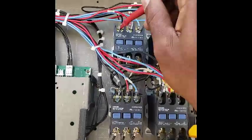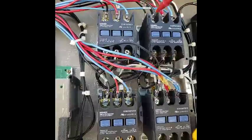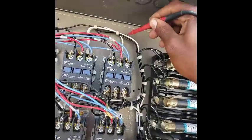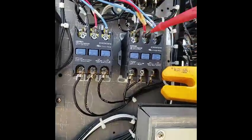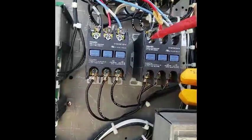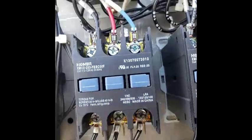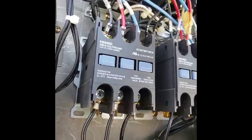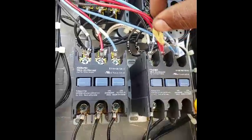Now I'm gonna check out the condenser fan motors to ground, right at the contactor first. These are the ones that were not blown, so I know these should be good. You can see this is grounded — if I touch this, see, it's grounded. I get to this one — see, it's grounded. It's two fans hooked up to this one contactor: you got 32-A and 34-W, so 31, 32, and 33-A — that's the back one. Then 34, 35, and 36-W — that's the front lead.